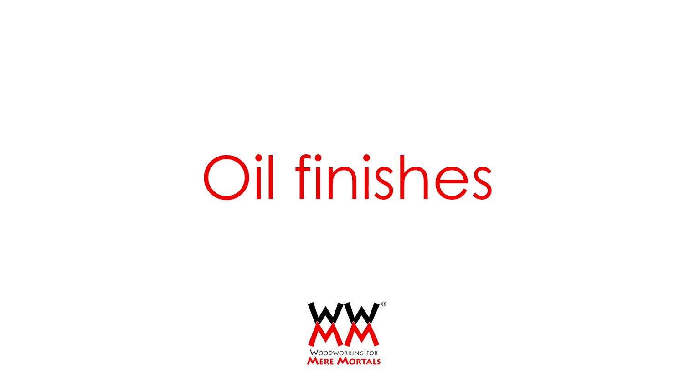When you want a beautiful finish that looks absolutely gorgeous and really shows off the wood, an oil finish is a great option. Plus, it's really the easiest finish to apply. But like I mentioned earlier, an oil finish doesn't offer much protection to wood. It would not be a good choice, say, for a dining table or a desk that's subjected to a lot of use. But an oil finish can be a good option for decorative pieces, say picture frames or jewelry boxes.